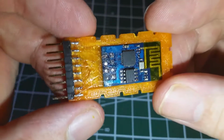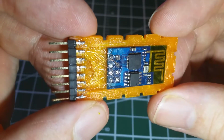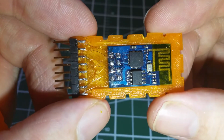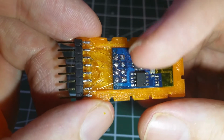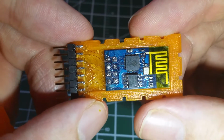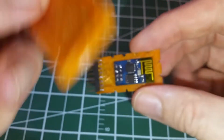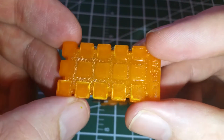As you can see, the wires are quite fine. I don't know what the gauge of that wire is, but it's for fixing jumps and traces in cell phones and stuff. And it's enameled, but the tip of your soldering iron burns the enamel off as you're tacking the trace down, so it made it really easy to do. And I just took the top row of points on the original 8-pin connector on the ESP, and I gave the first 4 pins the top row, and the last 4 pins the bottom row to make the wiring easy. Inside, this is the other half of the shell.